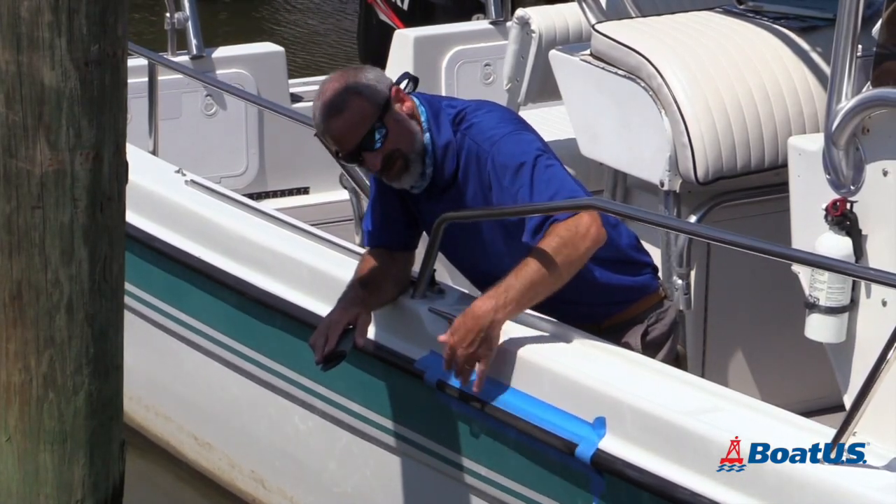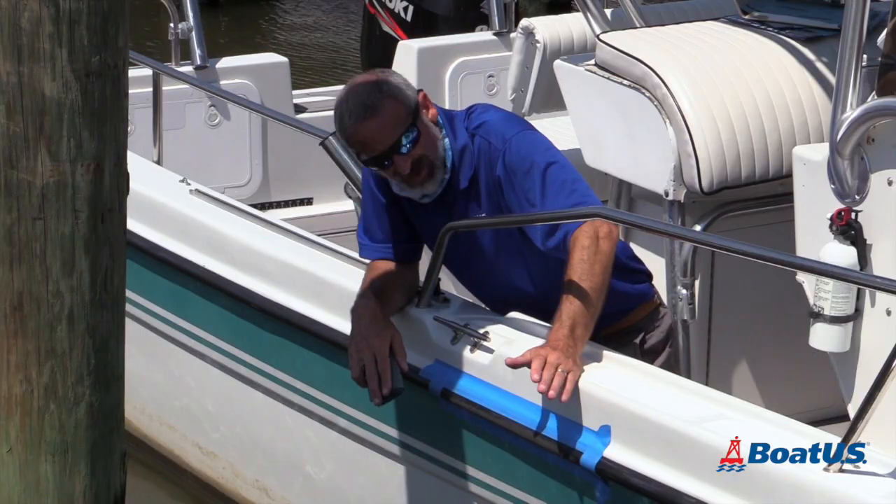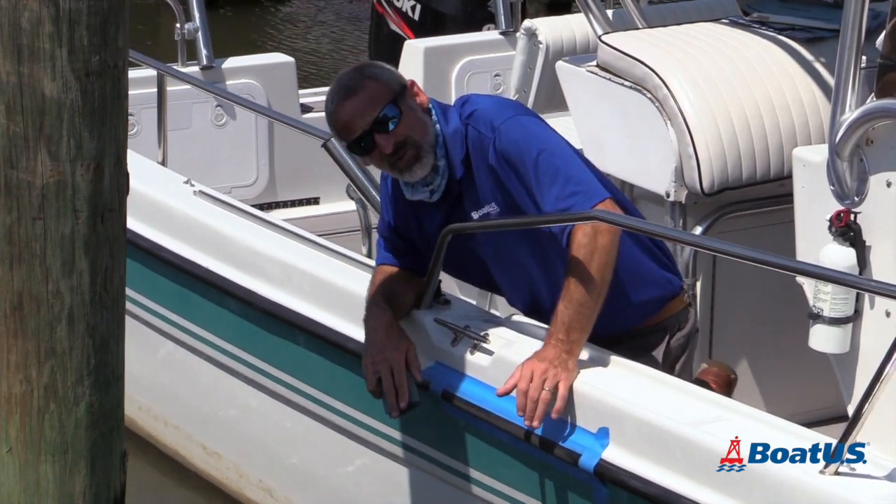All right, all the big stuff is gone. Now, as you can see, this 100 grit leaves a discoloration on the rail — really, that's tons and tons of tiny little scratches. So now we're going to step it up. I'm going to grab some 200 grit.